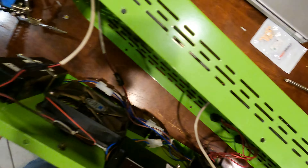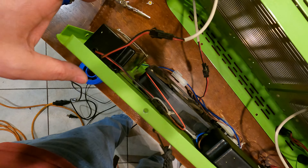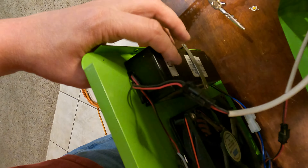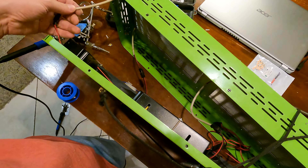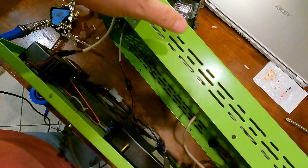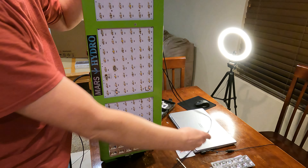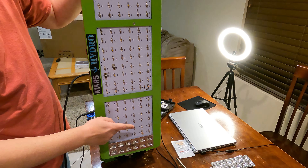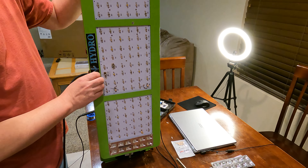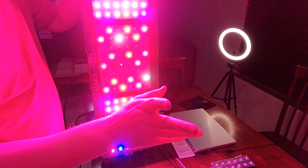Just as I suspected - the controller that's hooked up to this fan is also the one that goes to this board. I have the suspicion there is a bad capacitor inside it. I'm going to pull controller D out and for an experiment disconnect this side and hook it up to one of the other controllers that I know works, just to eliminate possibilities. I've got the controller swapped - turning it on to see if the bottom section lights up. And yes, it totally lights up! This is 100% a controller problem.